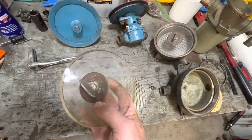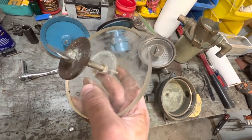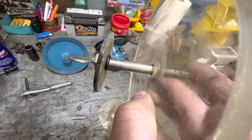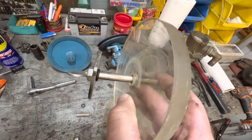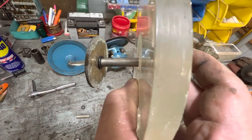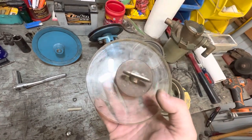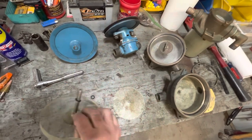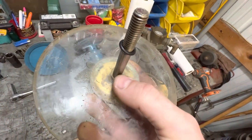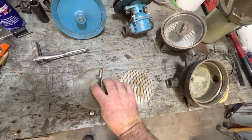A lot of times people forget that if there's a bolt going through your cap — sometimes it's glass, sometimes it's a big plexiglass like this — you're going to need an O-ring in there. Without that O-ring, it's going to suck air around that bolt, causing air bubbles in your strainer that will go up into your raw water pump. Also on the bottom side, there is a small concaved area around the bolt shaft — you're going to need something in there as well, so I put another O-ring in that concaved area.